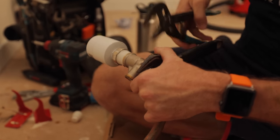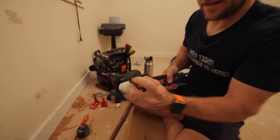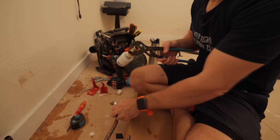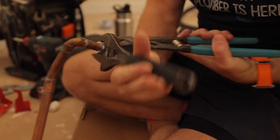If you're a cheapskate like me and you're going to use the same valves again, you might have to reuse or put a new olive on. No leak — all you putty haters out there. I'll also take the spigots out of the radiator.